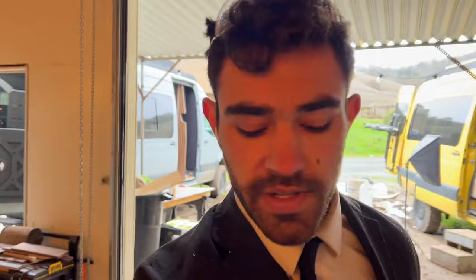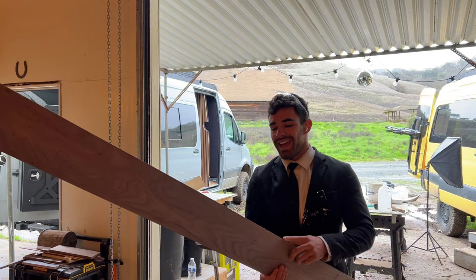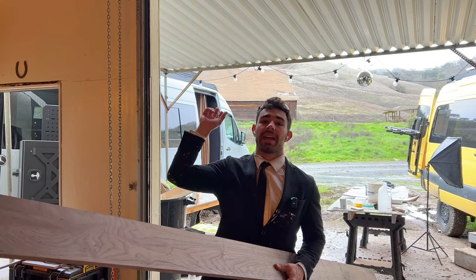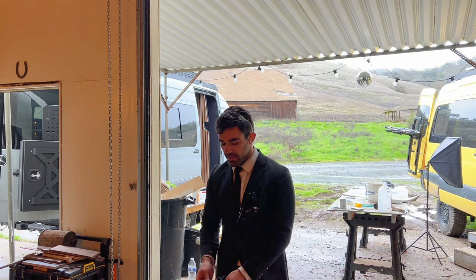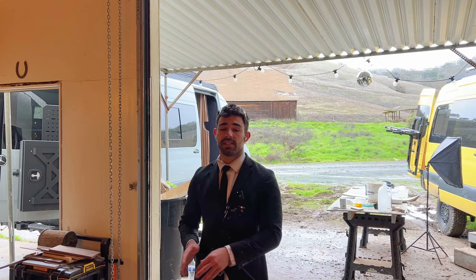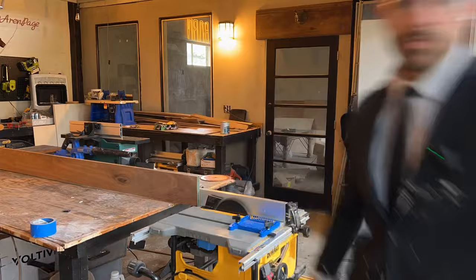The first thing we're going to do is move over to the table saw so I can take this one inch board and cut a quarter inch off to save on wood — I can use it for my slats above my bed instead of wasting it through the planer. I've got my table saw blade all the way up and the Kreg feather board in the miter gauge slot to keep the board against the blade for a nice cut.